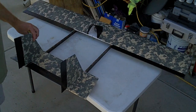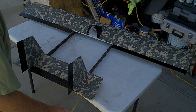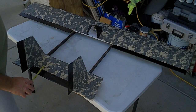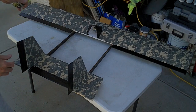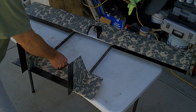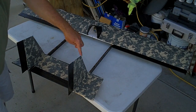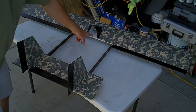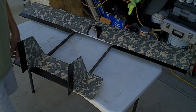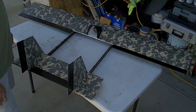Okay, so then in between, I've double folded this control surface here, the horizontal stab, and then I just notched out. So the spacing between is 14 inches on center. So these booms are 14 inches on center to each other, 7 inches from the center line, obviously. 7 inches to center line, and that's where the vertical stabs are. They're right over the top of that.